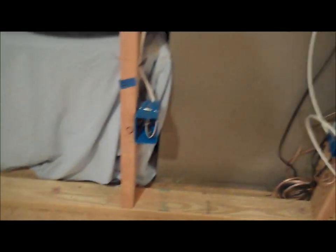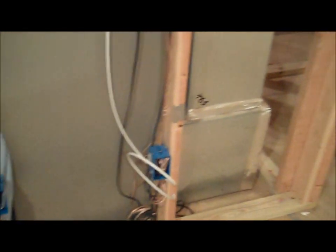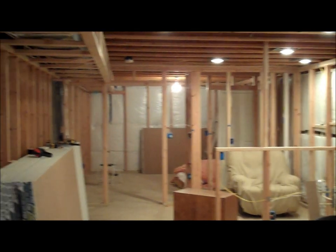Right down here we have an outlet where the main TV is going to be. As you back up, you can see speaker wire, subwoofer cable, and so on running all the way up, around, and down into the box right there. I've also started running the coax cable — this is coming in from the garage, comes down here, and that one will run up into the bedroom. I still need to install the one going down to the media room — about 75 feet — which should be done soon.